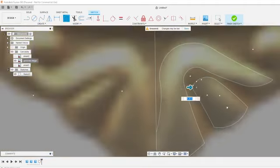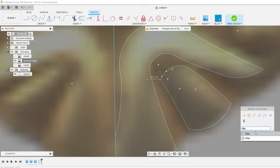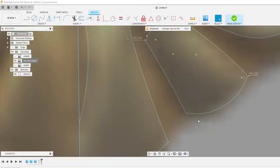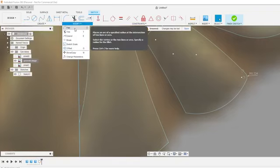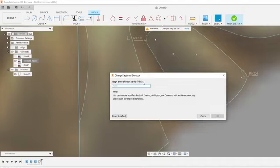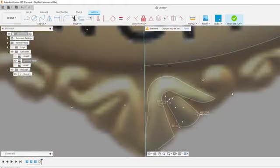You can also click corners when you're doing fillets, and it'll automatically know that that's what you're trying to do. Should make a hotkey for a fillet. Let's do that. We'll show you. So, fillet is over here. If you go to the command that you want, hit the little three dots to the right hand side, you can change the keyboard shortcut. Let's change it to H. H conflicts with hole. We never use the hole. So every time I click H, it'll just bring up the fillet command now.